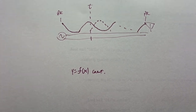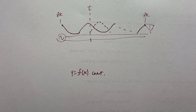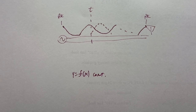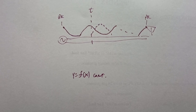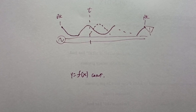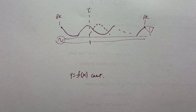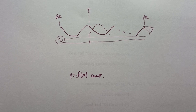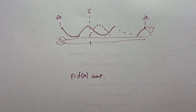because the way to look at that is that the line is being phased. And phase is a ratio or proportion or relationship between several or more things, kind of like a ratio. The phase of a sine wave is reckoned from 0 degrees, or the 0 voltage at the baseline. And the first peak is a plus 90 degree phase, and the second minimum at the 0 line is the 180 degree phase. That's relative to 0, so that's a phase. But in this instance, there's a phase relationship between two separate mathematical functions, the forward wave and the reflected wave.